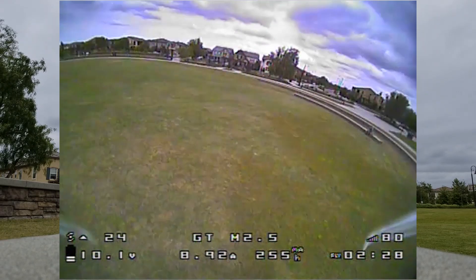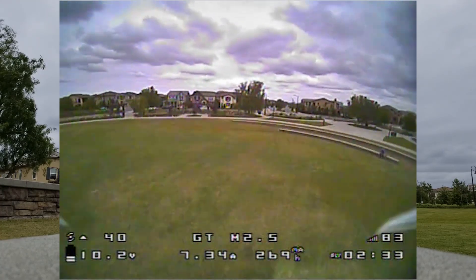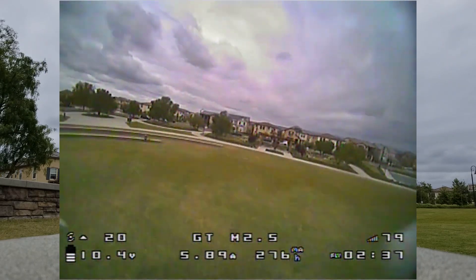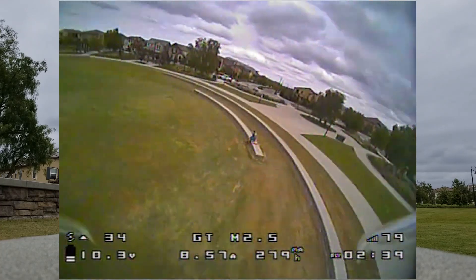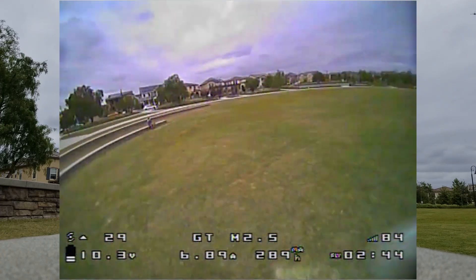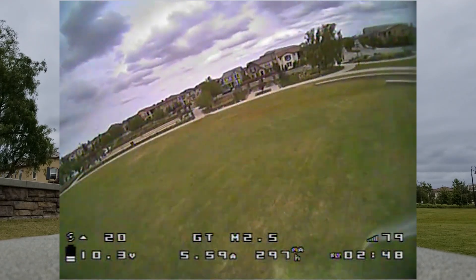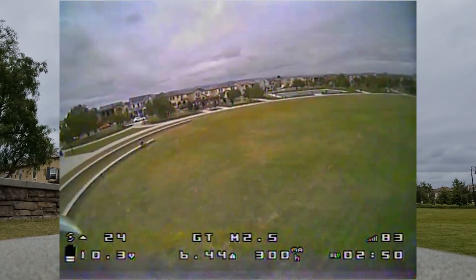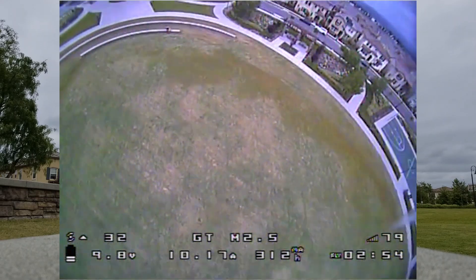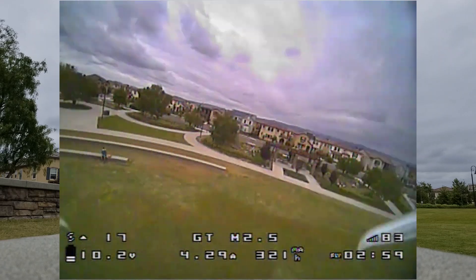It's starting to feel and sound a lot better. The rolls are more snappy, and they stop — I like the P gain there. I might need to lower the D gain just a little bit more, possibly on yaw. I think the yaw axis seems to be affecting the sound of the props. It's greatly reduced — it's not as bad. Let's land one more time and try to drop that again.